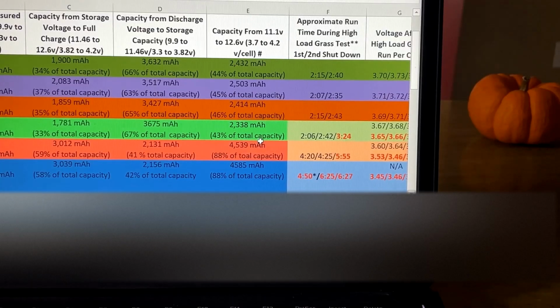half of that. Folks that have followed my channel and have seen my testing will remember this spreadsheet from my 3S testing. And as you can see, the lower performance, lower quality LiPos were around the same percentage of voltage from 3.7 volts to full charge as the Li-ion batteries. So, around 40-45% here, whereas the higher end LiPo batteries that were mostly comprised or completely comprised of LCO had about 88% of their total capacity from 3.7 volts to 4.2 volts. So looking at this, the Liperior actually performed really well.